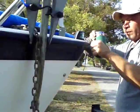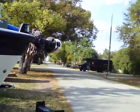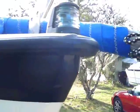Double check in there, you can put a C-clamp on her nose to hold her in place if you want. Yeah, and then it'll stay in place. Now actually it's a pretty sharp turn in there, and you have the rubber wanting to pucker up along the top, and also a little bit on the bottom. While the 5200 sets, we think it's a good idea to clamp it down, so that once it does set, it will stay put, and that's all that's really required.